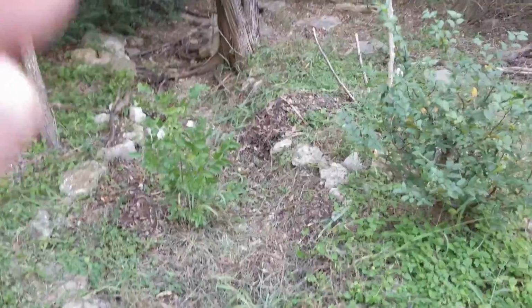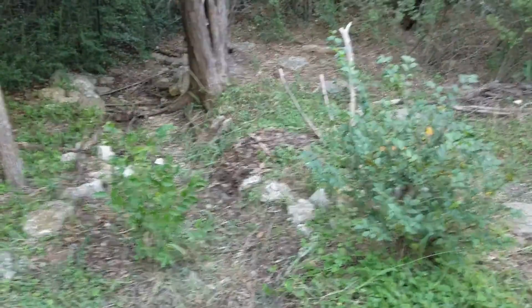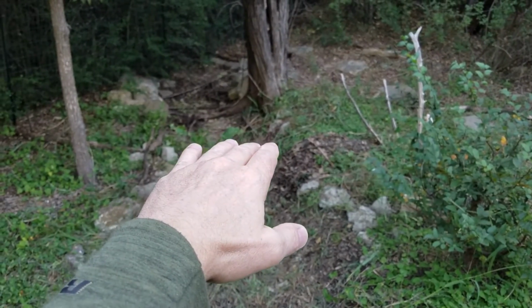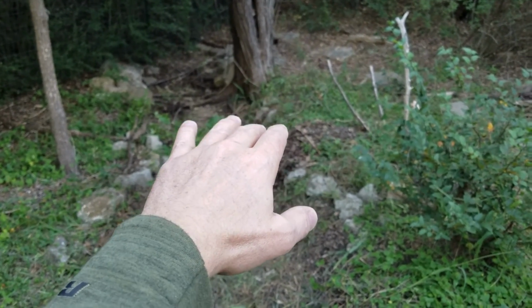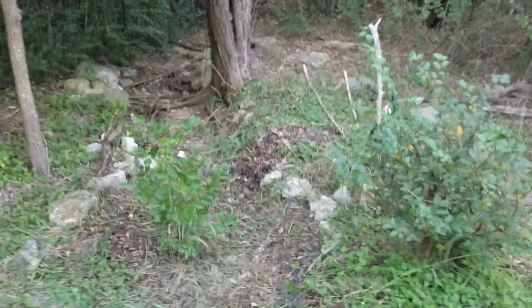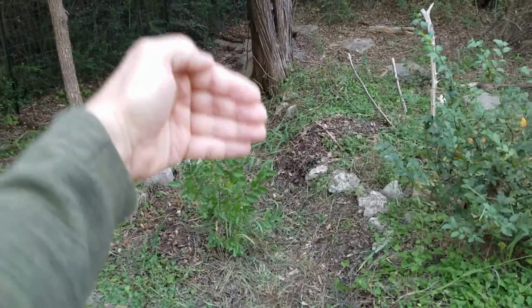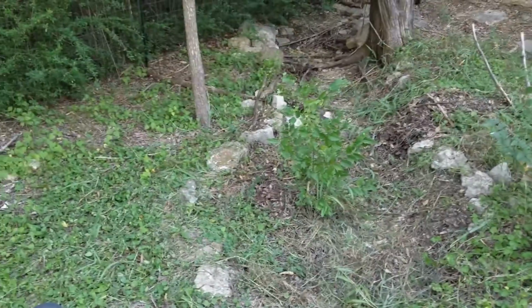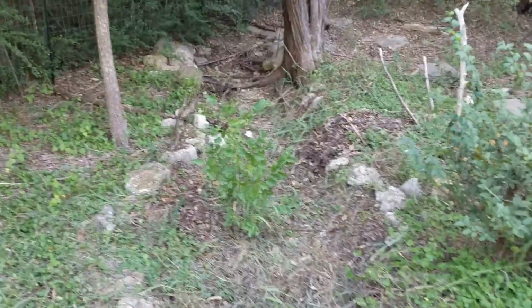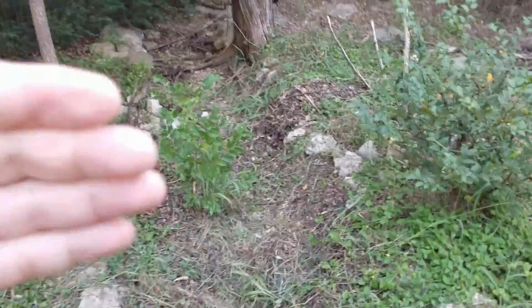So that's the idea. And then of course the berm, like I said, would be all off of the easement, so they won't be able to touch that. And that should cause the water to pile up here about 2 feet deep, maybe 3 foot deep, depending on how high I have to build that berm. And it should make the water drop its debris inside the berm and flow down the first drain spout before coming down the creek. Now, of course, some debris is going to make it down the original creek flow.